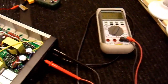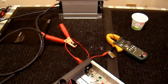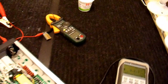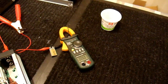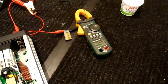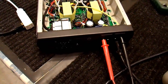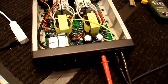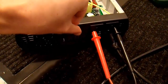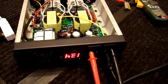And here's the plug to my power supply, so let's power this thing up. This power supply is about 13.5 volts if you don't have a battery connected, which I don't. So let's see what happens. So far nothing — I know that the input is powered, but it's drawing no current. That's good because it's off, and when things are off they should be off. I'll take the power button here and see if it works or explodes or what it does. Okay, it scared me slightly, but it is working.